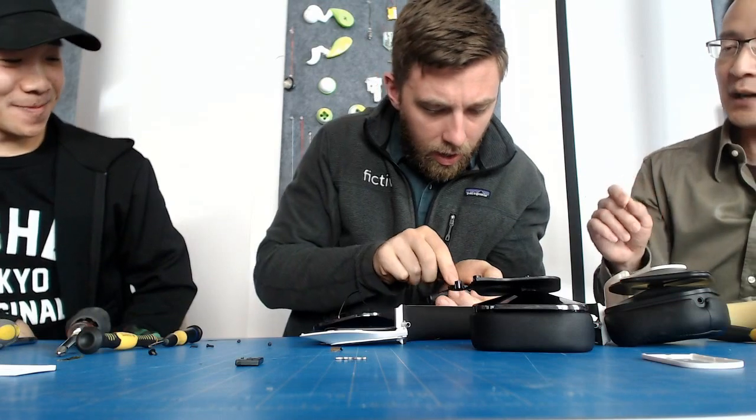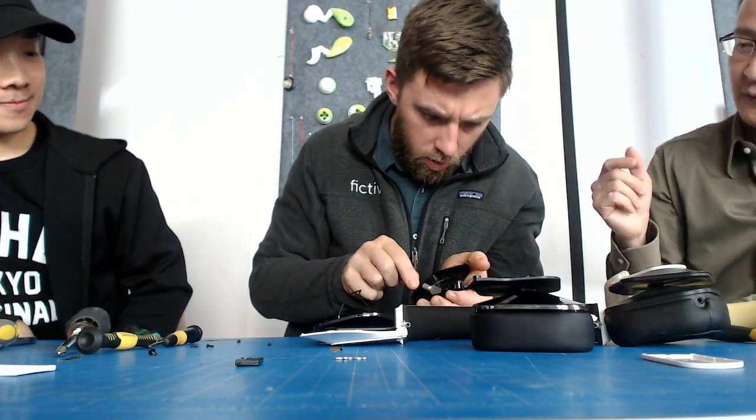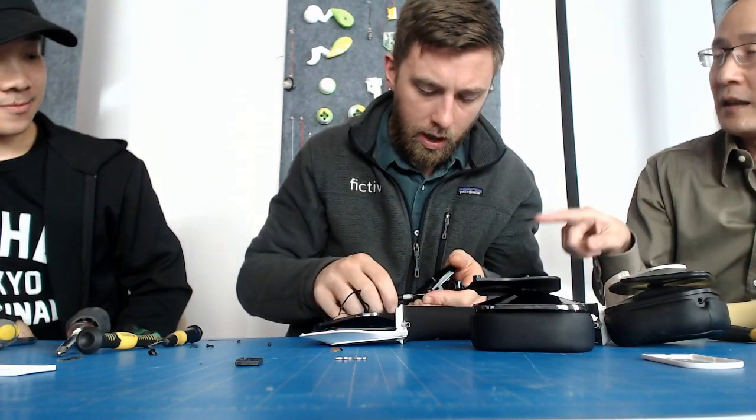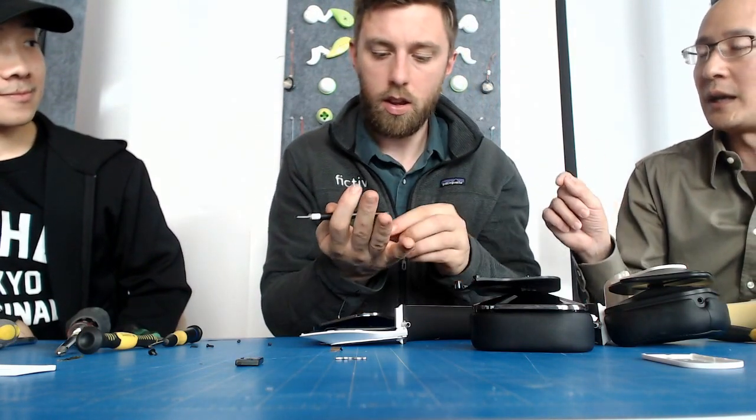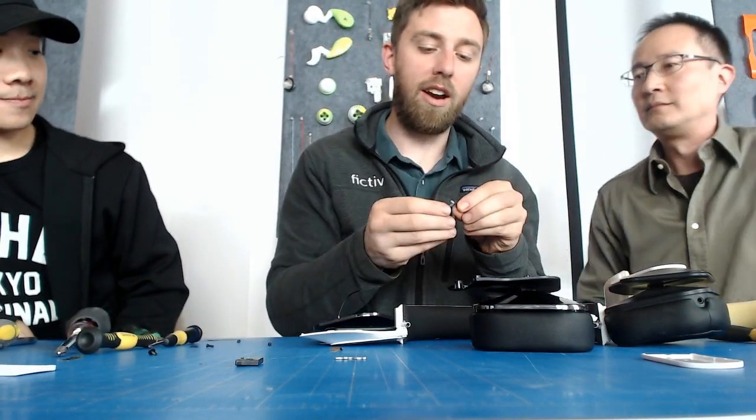So we actually reflected it off the bottom edge and bounced it up, and it was enough for you to see the light. And the part, if I recall correctly, is painted and laser etched to reveal the light. So this is entirely molded in clear polycarbonate. So I'm going to just slow that down because I think light pipes are always fascinating.